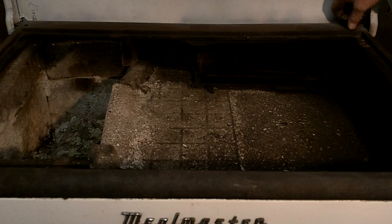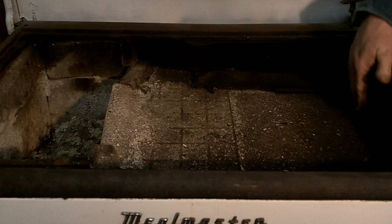Now we've got our top off and there's a flap in the rear — you can see it open and closed. That's my oven control. If I've got it open, then my heat just goes straight to the rear of the stove and goes up the piping out. If I want to use my oven, I'll close the flap and it'll come across like I said.